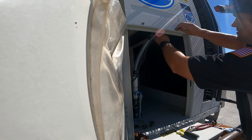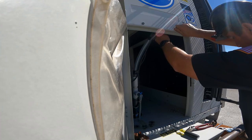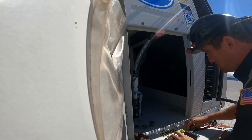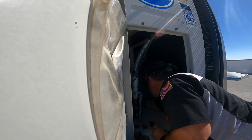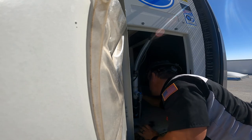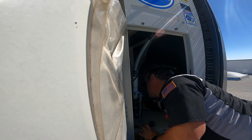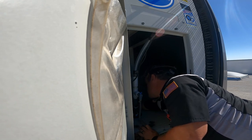So here it's very dry. It's about 17% humidity compared to a place like in Florida or Texas where the humidity is a lot higher. This system wouldn't really work as well as it does out here in a lower humidity climate. So it does get hotter out here, but very low humidity. So this is a perfect unit for this system here.